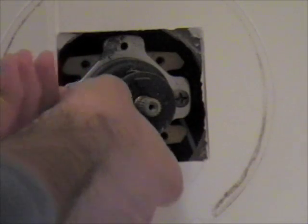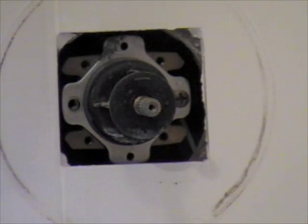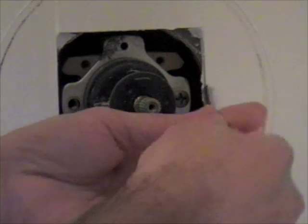I've turned the water off. I drained water. I turned on the water up above here in the sink, and I opened a drain. I opened the faucet downstairs, let the water drain out. Got a couple of screws on the sides here we're going to get out. Make sure we don't lose them in the wall. Set them aside together so I don't lose track of them.